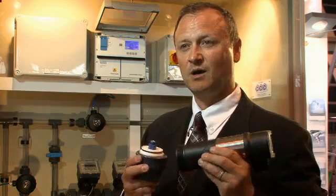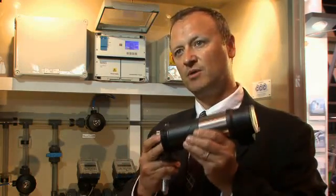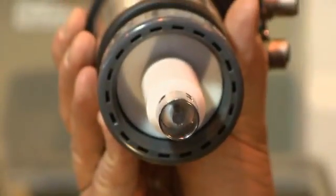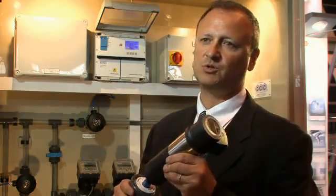In an application such as reverse osmosis, where I want to monitor both pH and ORP at the feed of an RO, I can use the same part number and same inventory to do both of those applications. If I was doing on-off conductivity control, all I need is the conductivity transmitter and a valve. If I'm dosing pH on-off and I want to run a pump if I reach a low level, this will also do that as well.